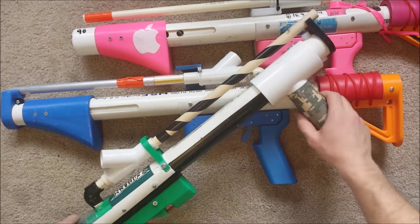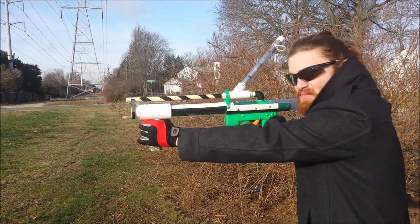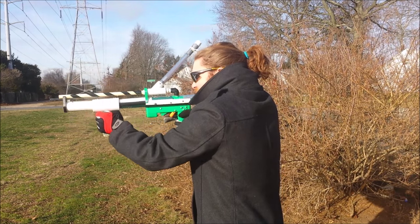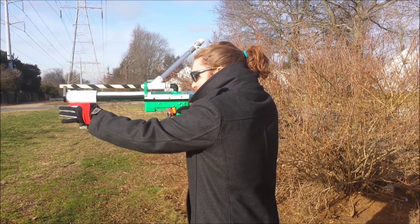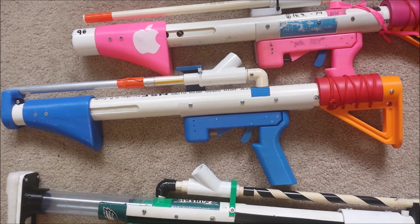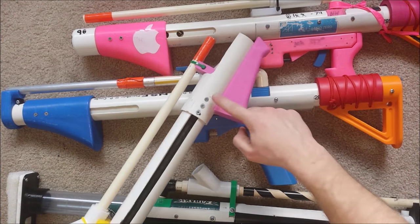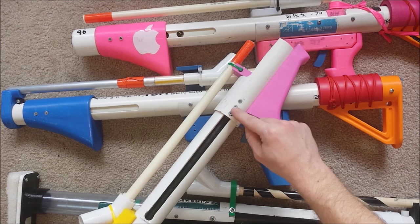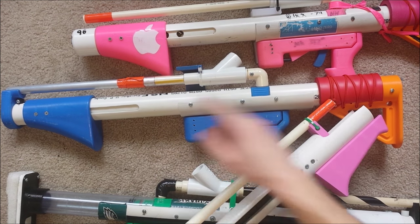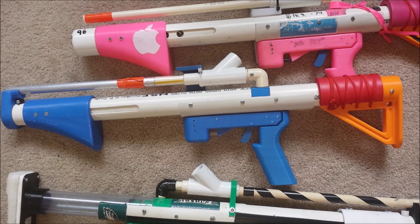This is how Drev got around it — I think this is how the original ones were. Instead of a 3D printed ABS pump, you have a solid injection-molded PVC T, which isn't going to break no matter what load you put on it. I think this is superior in terms of durability, though it does add a lot of weight. A compromise — if you're doing your own modifications — is to have your injection-molded or extruded piece as the load-bearing component, then add a 3D printed part for ergonomics so the main stress is not borne by the printed piece.